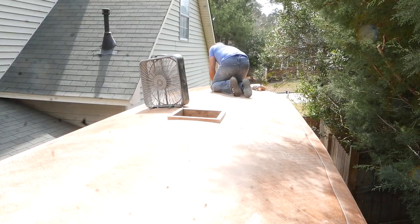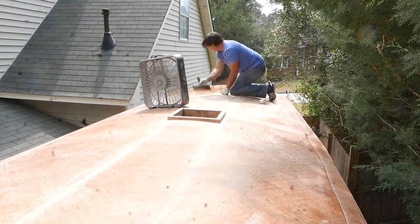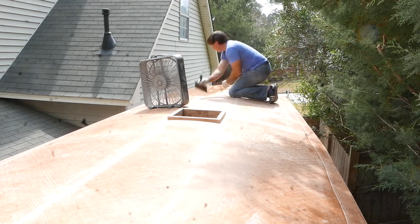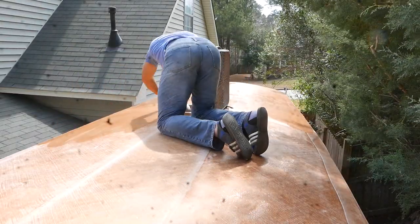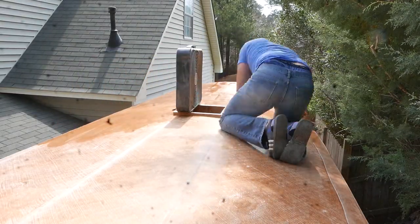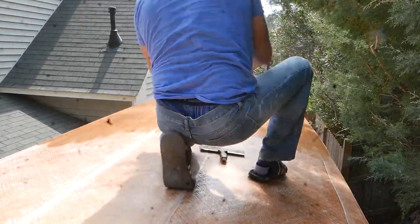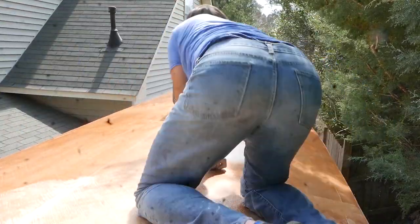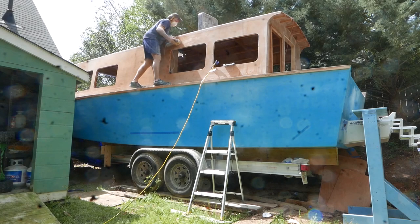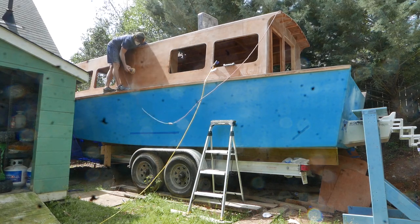Next, we spend many weeks fairing the cabin, cockpits, and side decks. All surfaces receive a coat of thickened epoxy, which is then sanded to smooth and flatten any imperfections. We repeat this process three or four times for every surface on the boat. This is critical for a good painted finish later.